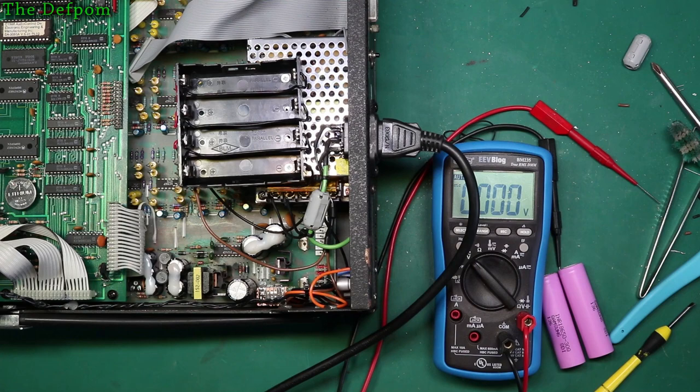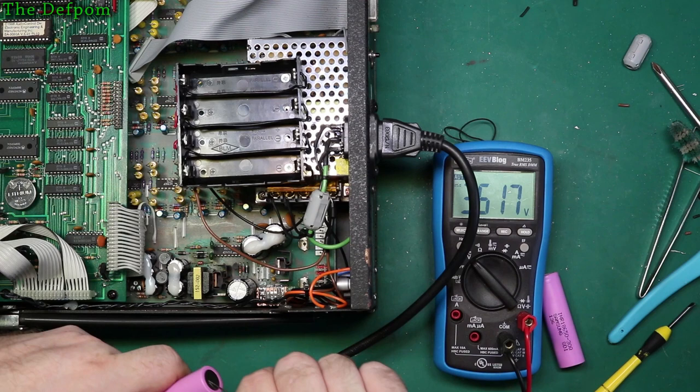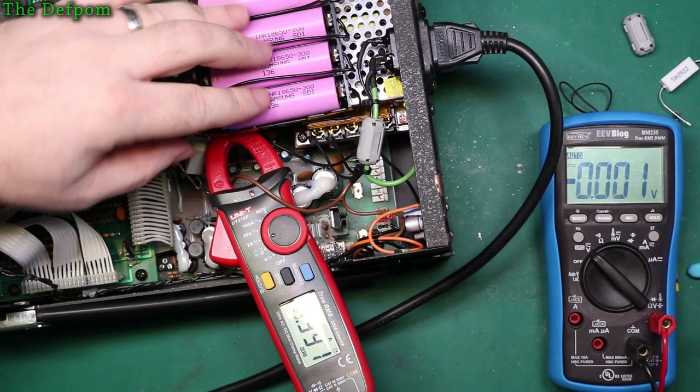What is the voltage just on these batteries right now anyway? So look. I'll have to look at some solution for that. That could be horribly wrong. Okay, so I'll play around with this a little bit more. Obviously I can't have 6 amps current draw potentially while I've got flat batteries in here. That is just asking for trouble. It'll end up blowing up the power supply.